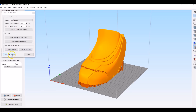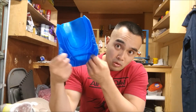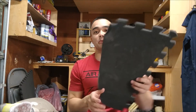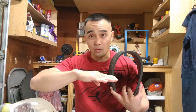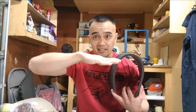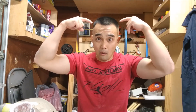All right, so here's that shoe that I was telling you about. It does not have any supports from underneath it — I didn't print anything underneath it. You guys can see little fuzzies down there because I need the retraction adjusted. Anyway, this thing printed with no supports, and here's why. Let me take this piece of foam right here. When you have this shape right here, it prints on a horizontal plane — print print print print — it's fine up until you get to about here when it's starting to become horizontal. That's fine because it's not parallel to the build plate. If it was hanging like this, right, this edge right here, then this is going to need supports, but the rest of it won't.